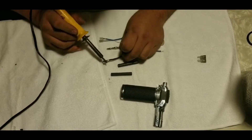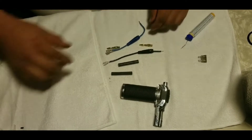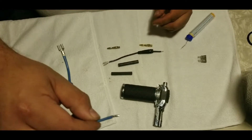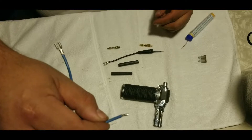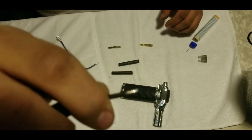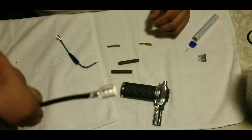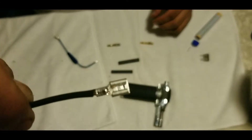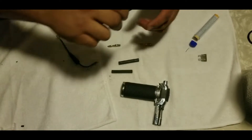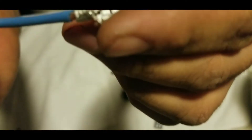That's the only reason I use the soldering method, and then I solder where I crimp the spade connector — the female spade connectors. It's testing equipment that I'm building, so I typically want it to be pretty solid so it'll last me a little longer than normal.